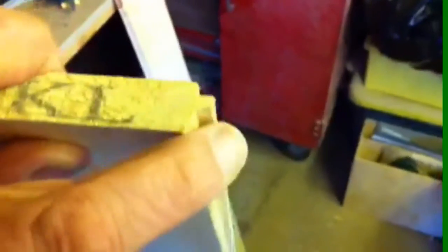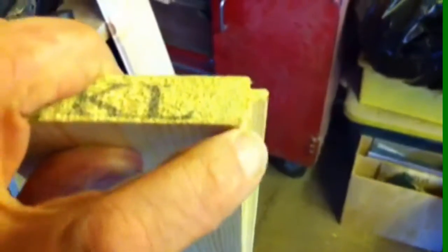It's more or less finished now, apart from the back and the 4 pegs. The back's pretty straightforward, it's just VT and G, this stuff. If you look at the section, tongue and groove with a chamfer here and a chamfer here, which gives it the V groove, and that'll just be mounted at the back behind there, and that'll be not glued, that'll just be pinned on. So I'll get those on, and then we've just, like I said, the pegs.